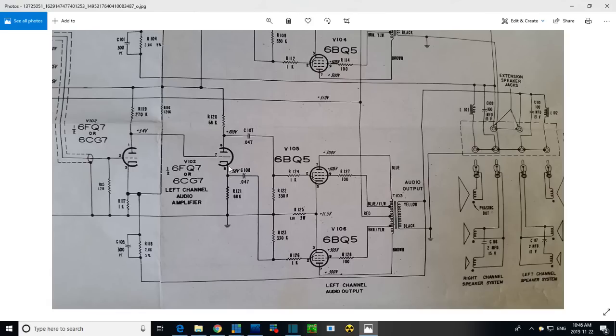You can see right there, it gives it 58 volts normally. This is what we're going to get in and start checking around. If the cathode's at plus 58 and the grid is at plus 34, the grid is actually minus 24 volts relative to the cathode. The actual bias on here is minus 24 volts. Right. That's quite a bit for this tube. How the biasing is done back here, I'm not sure. I don't know what they're doing back here. I won't worry about that.